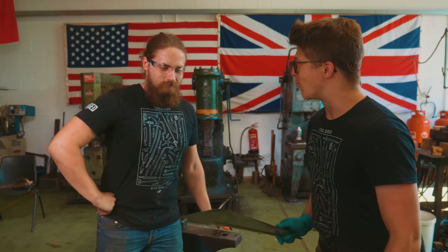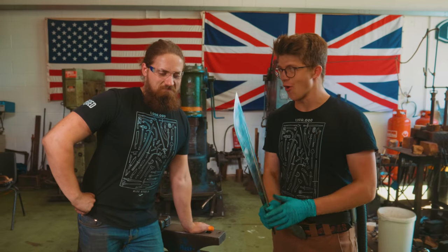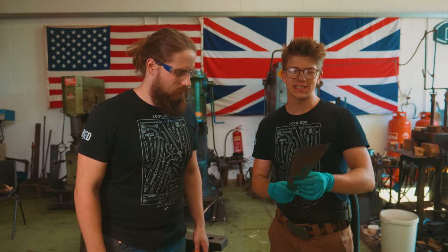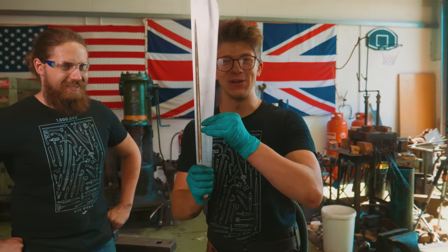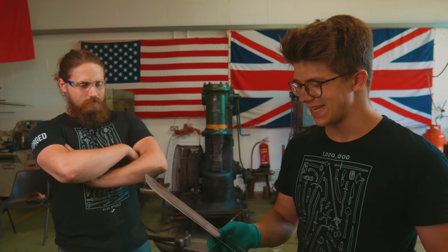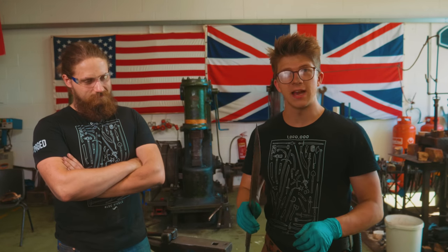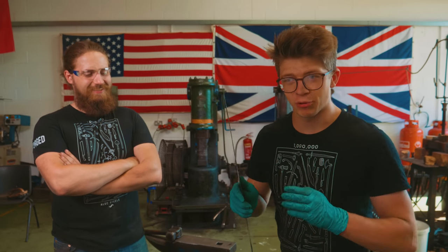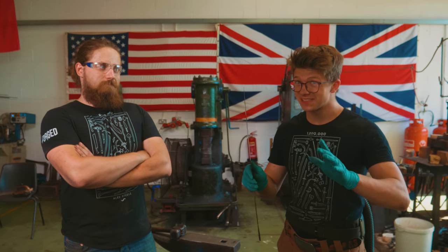So this now weighs 419 grams. Oh my goodness, that fuller took out a serious amount of weight. We've got a beautiful convex on it, which is nice. It means that hopefully we're gonna have a very well supported cutting edge. Right now our steel is at about 20 thousandths of an inch thick, about half a millimeter. You wouldn't make a chef's knife with that thickness before your primary cutting bevel, but this needs to be tough, so I think it's gonna be about right.